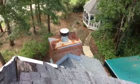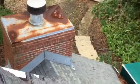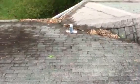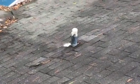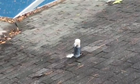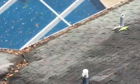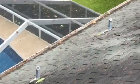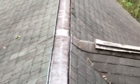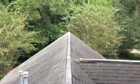You can see down there that chimney cap is rusted out — we need to talk about putting a new one on there. All these plumbing boots, the top lips have been torn out by squirrels. The gray is the flashing, the white is the pipe that the gray is protecting, so anywhere you see gray and white with a gap in between is a void that will allow water in, and every one of those has been gnawed on.